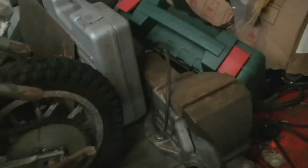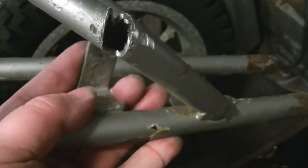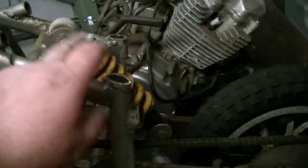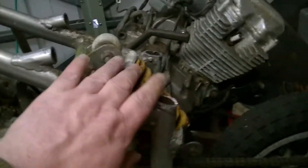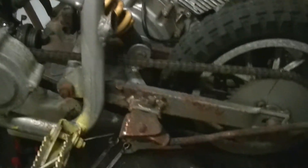That's quite heavy. Basically, if you follow that bar it'll end up running down like that towards the back wheel. Obviously the back swinging arm is going to be higher, so the back wheel will be higher. My next job is to take the shock off and put a bit of wood or metal in there so I can adjust it to where I want it, and I can leave that in while I rebuild the back of the frame.